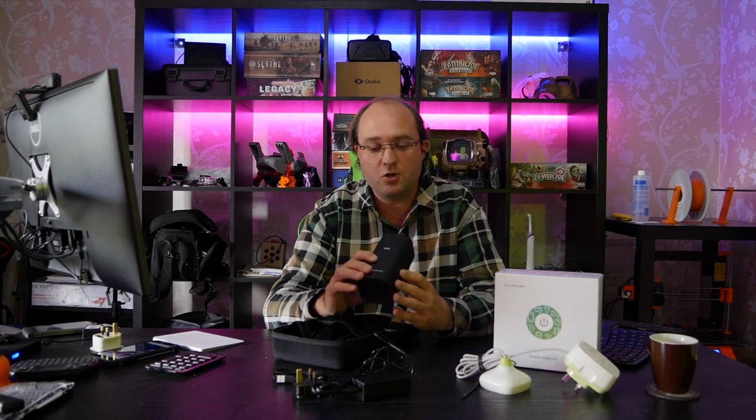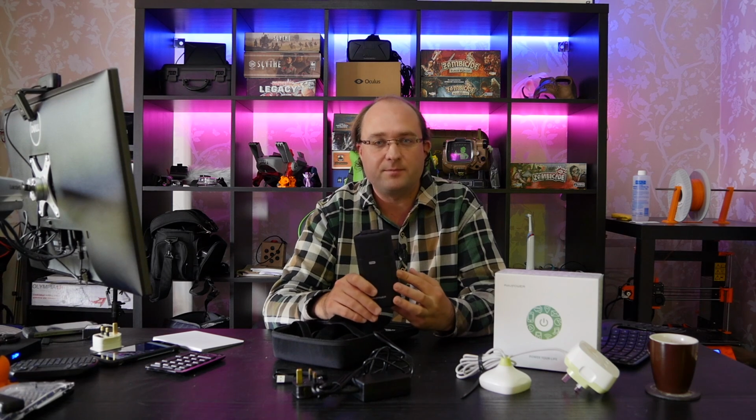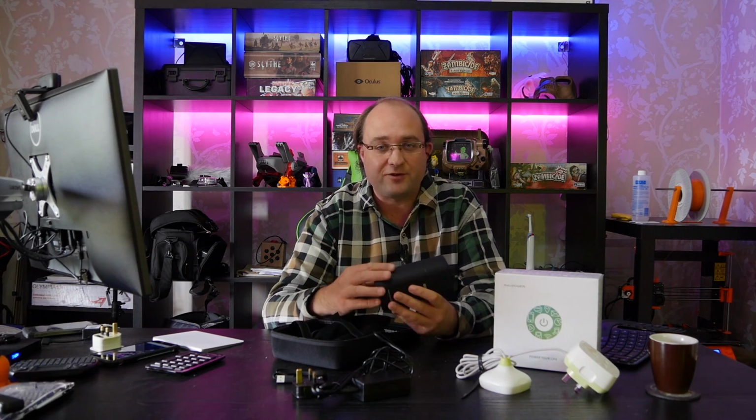For AC power then, running 28 watts for 2 hours comes out as about 55 watt hours total storage. The capacity is stated as 74 watt hours, but of course when you're converting from one source to another, then you're going to lose some of that in conversion inefficiencies, and this is true of any battery technology really.